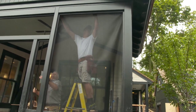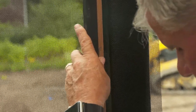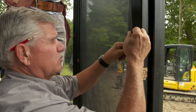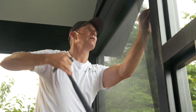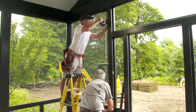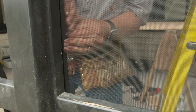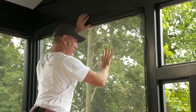Now we're going to pull the screening wire across the opening, eyeballing it so the little squares look like they're level, and push the stop against just like that. As we push it in I'm holding this with my hand but also letting it go, still keeping tension on it so that this part of the screen gets tight. Now it's ready to go in — push this into the dado, put one screw right here, and work my way down. Jeff's going to start at the top and we'll pull it across adding a little more tension, forcing the stop into the rabbet and putting another screw in. The rabbet tucks the screen in and creates that tension.